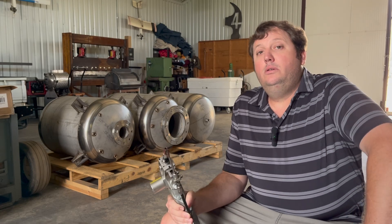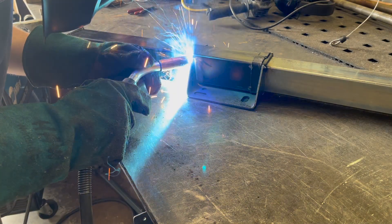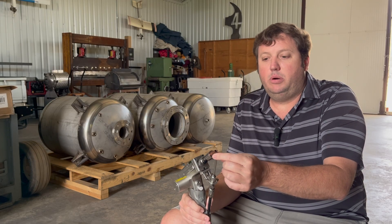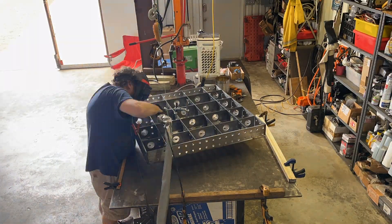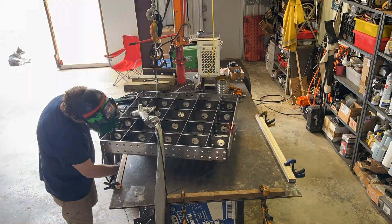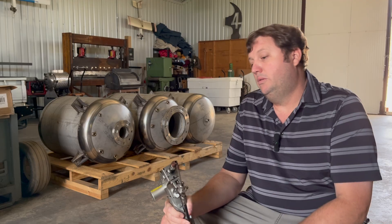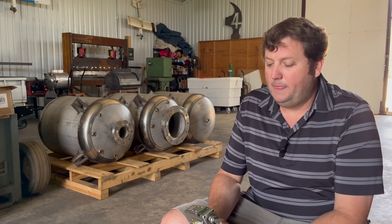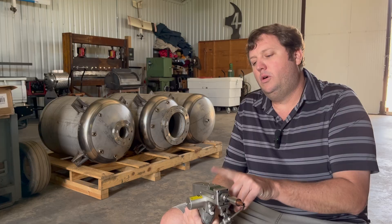This needs very clean protective glass. You don't use as much wire as a MIG process — MIG uses the wire to create the arc, create heat, and deposit metal, whereas this is straight depositing metal. I'm still on one roll of wire where I would have gone through three or four rolls with MIG. Consumables-wise, I'm still on some of the original consumables, and the only thing I've had to replace frequently is the protective lens, which ranges from six to seven dollars.